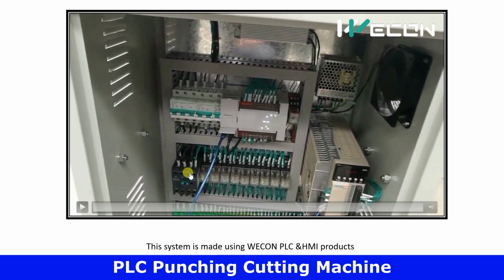Here this is the main contactor. The purpose is, for example, if the utility supply is gone and then it comes back, we don't want the machine to start automatically. It may cause damage to property, equipment or a human. So in every machine there is a contactor for manually switching on and off when the supply is gone.